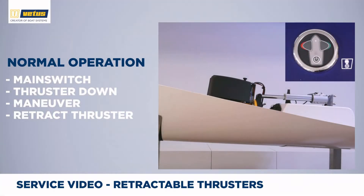When you are ready to start maneuvering, make sure that your boat speed is below 3 to 4 km/h — about walking speed. If you go faster than this, it is a large surface and the thruster might create too much drag for normal operation.